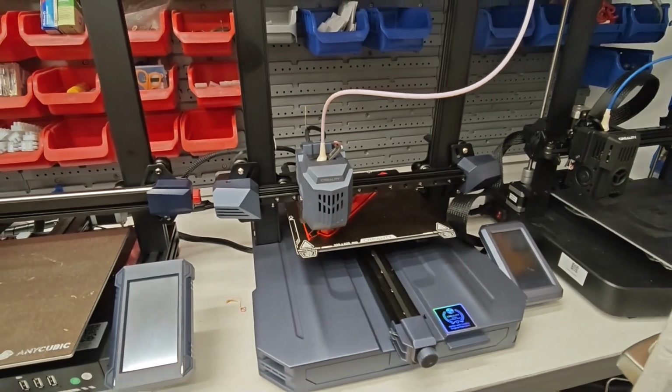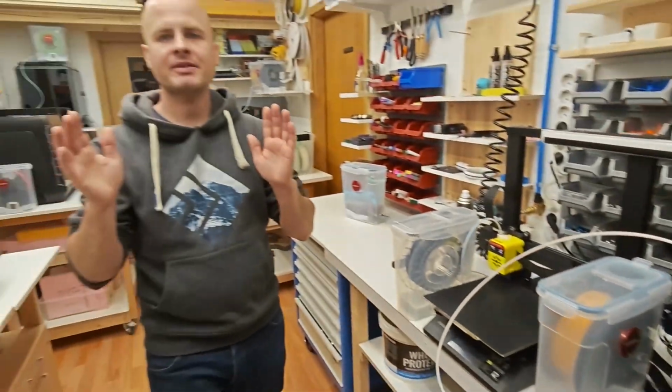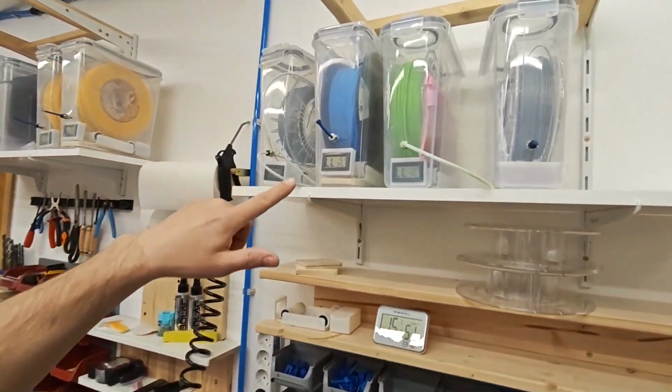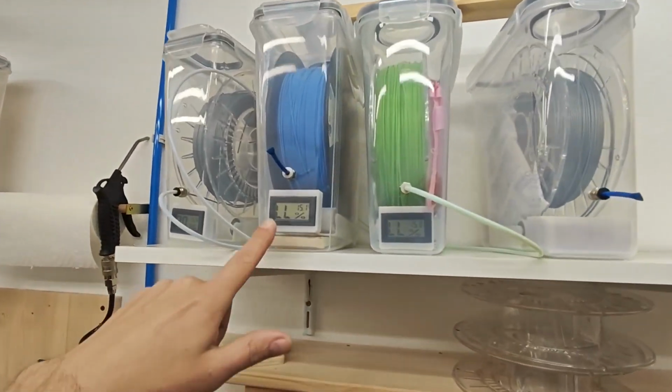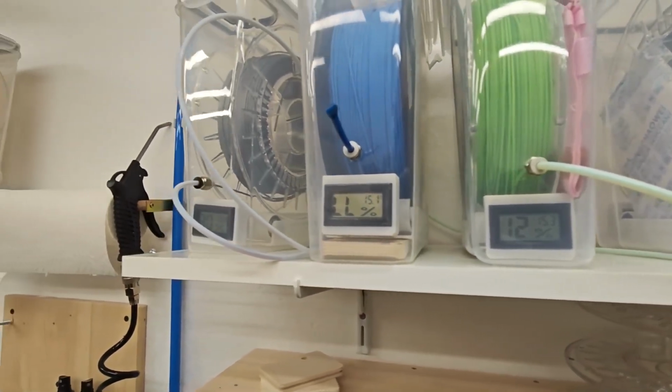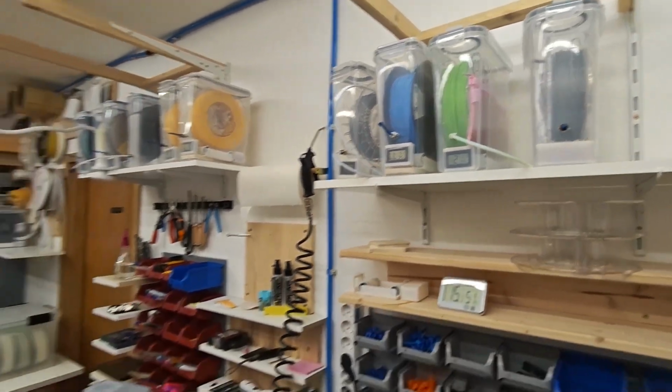This is just a trestle, so this is no big deal. But when you print your airplane, then room temperature and humidity should be 20 degrees and 20%. So 2020, you can remember it. And store all your material in these dry boxes. You see here I reach super low humidity. You can also dry your material in these dry boxes. Your print quality is much better when you have dried lightweight PLA.